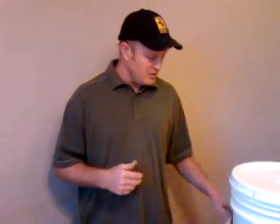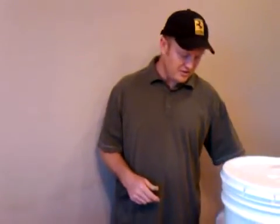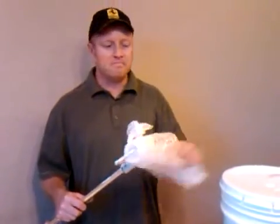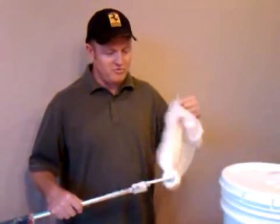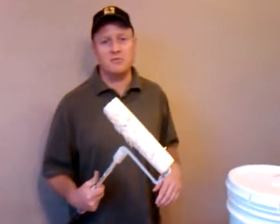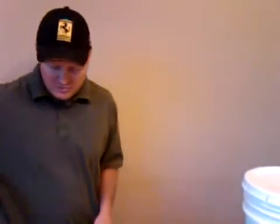So first of all, if you do have to take a break, maybe someone comes over, maybe a kid falls down and bumps his knee, you have to take a break for just a few minutes, whatever. Just grab a grocery sack like you get at the grocery store, and just wrap your brush or your roller in it. It'll keep it wet, keep it from drying out, and that way you won't have any problems when you get back to your painting job.